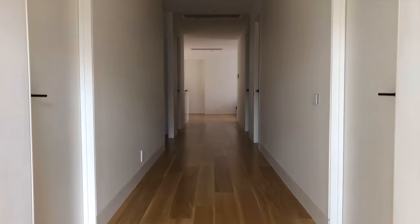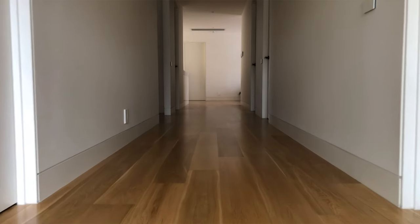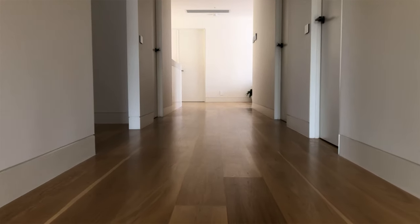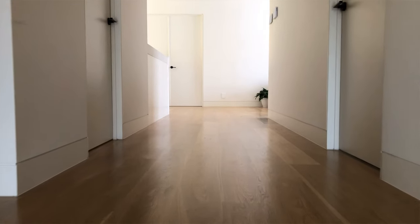The first tip I have is to make sure your frame is well prepared for shadow lines. One of the difficult things about working with shadow lines is that they will accentuate any imperfections that you have in your frame. It's really important that your walls are straightened from top to bottom, just like how they have to straighten all the way up to the top for square set plaster ceilings, you need to straighten all the way to the bottom.